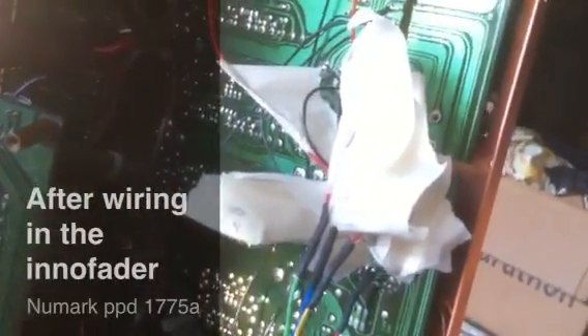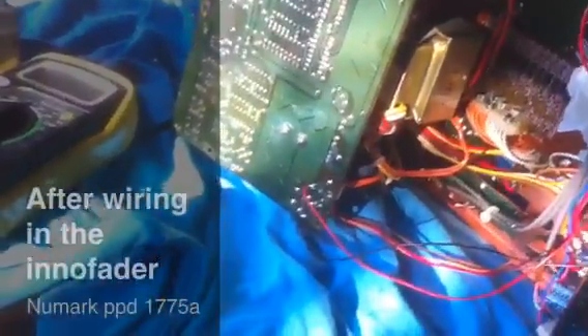I got it all set up right here. I'm doing some final tests. This tape here is what I use to tag the circuits that were required for the fader to work. I tap my power from the rectifier circuit on this board — I checked and the voltage was within the right range, which was about 10 volts. I shrink-tubed all this stuff here, so everything's nice and neat.